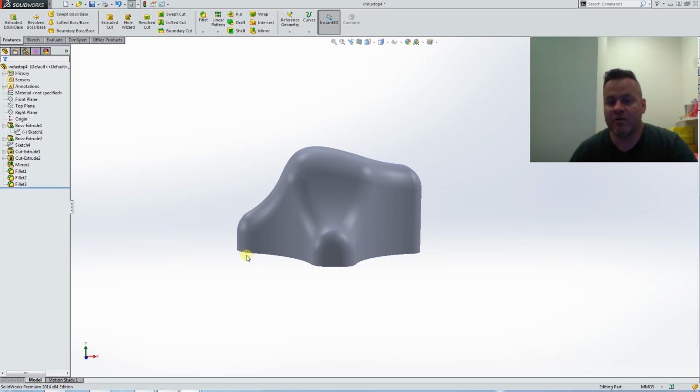And if you look, there's nothing that overhangs this way, like when you're 3D printing where you have an overhang and need supports. You can't do that when you're vacuum forming, because what would happen, looking at my mouse, is the plastic will come down and then it would suck up underneath, which means that you could never remove this mold from the vacuum forming. You'd have to cut it out and create slits, or you'd have to create a multi-part mold, so you pulled out a center and it allowed the sides to collapse in and then out the bottom of that. So you can do undercuts, but then it's a real complex mold. Here we just wanted a simple straight, so everything is working with what's called a positive draft.